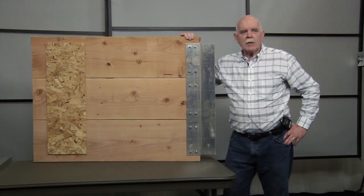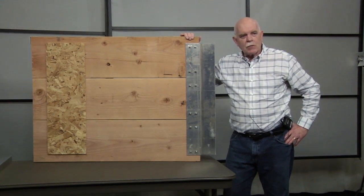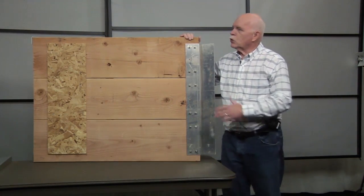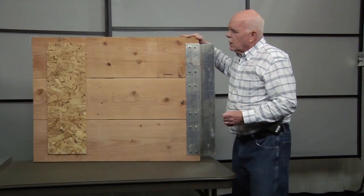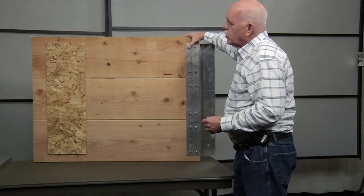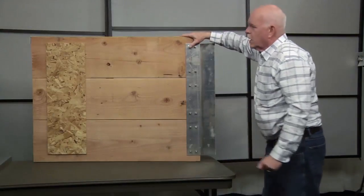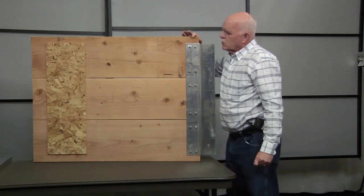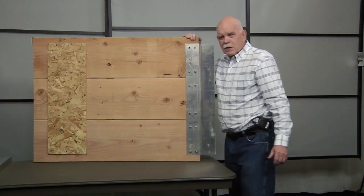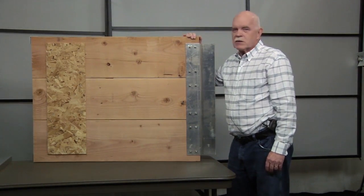Okay, let's get oriented by looking at a finished ramp first. Obviously, this ramp is relatively simple to build. You'll notice this is a short, what we call threshold ramp, because it doesn't have enough space in the bottom to put 2x4s. We use the tie boards with 1/4-inch masonite or plywood. So the deck is made of 3 2x12 boards, the length that you're interested in. The lengths come in 8, 10, 12, and 16-foot lengths.